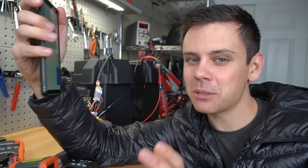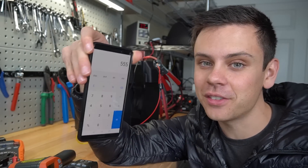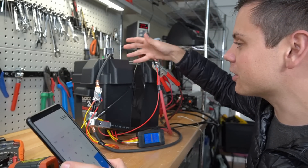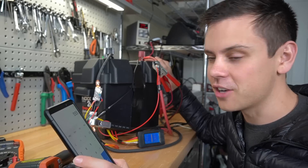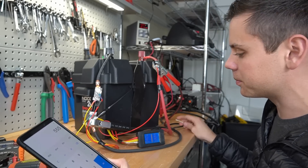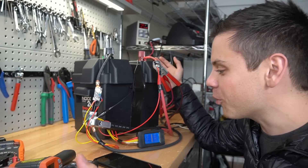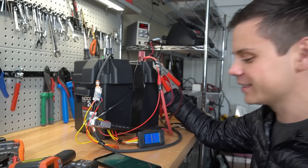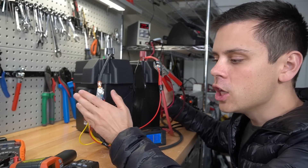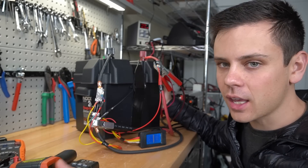The total cost for this battery including all wires and internal connectors was $555. This battery can do almost everything that more expensive batteries can do - it's the equivalent of an $800 to $1,300 battery like a Relion 100 amp hour. If you're on a budget and build two of these for about $1,000 and then buy an MPP all-in-one unit, you could have a full solar power system that is very capable for about half the cost of anything else on the market.